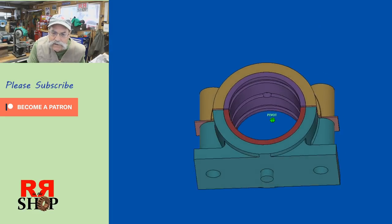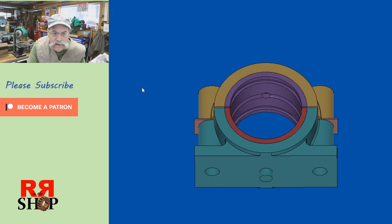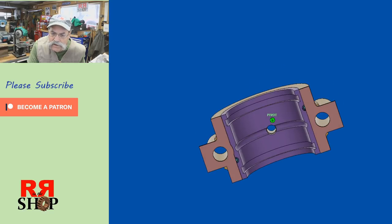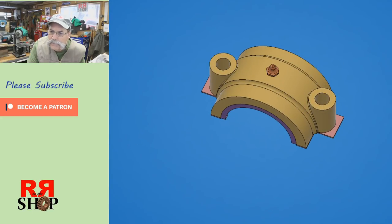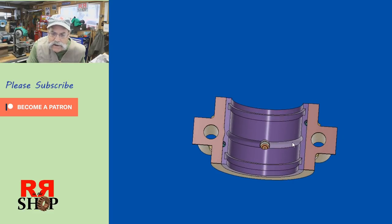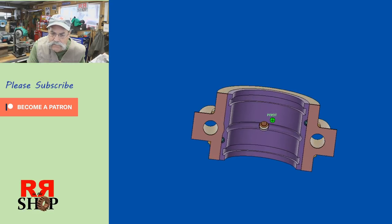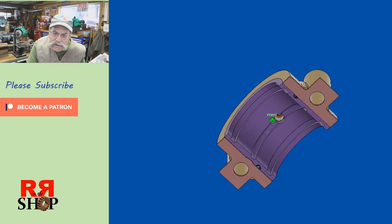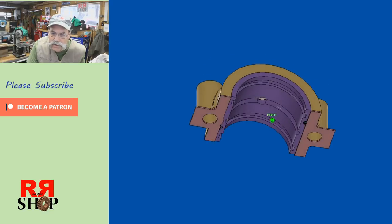Now the top half will have a grease groove. Let's see if I can show you that. So the top half of the shell is going to end up with a grease groove in the top only. And of course a grease fitting will be up on the top here. A Zerk fitting will be in here. No need to have a grease groove really go all the way around in this type of shell. We'll have all the support on the bottom, and this grease will get down into the bottom. And that way you won't lose your bearing pressure. So on low speed bearings, this is kind of a recommendation. So that's what we're going to do.